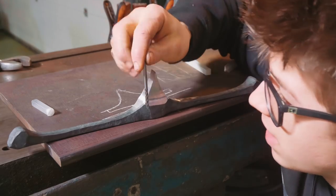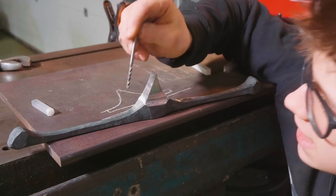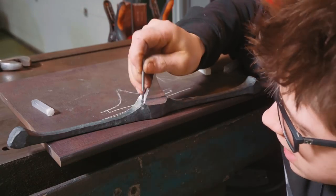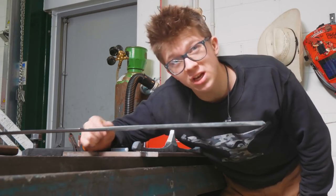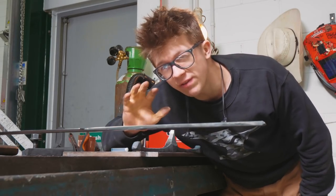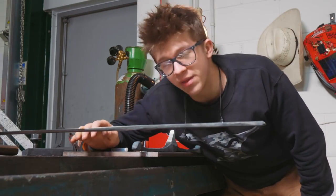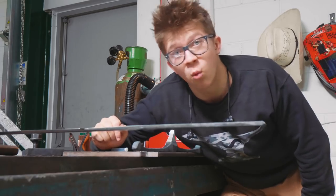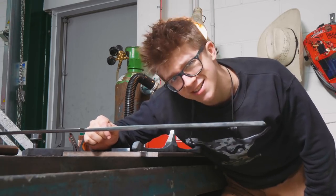from time to time. Yes, 4mm, 55mm away, this is going to flex a lot as it's taking a cut, and it has a very high risk of snapping. Now, I used to have two of these end mills, so I would have had a little bit more of a leeway. I could snap one and then maybe use the other one, but there is a reason that I only have one of these end mills now. Draw your own conclusions as to what happened to the first.